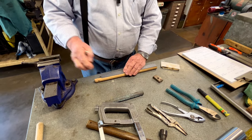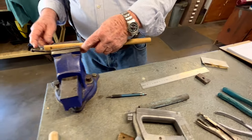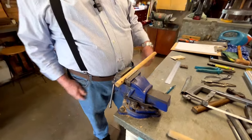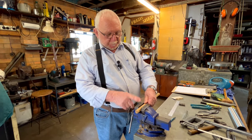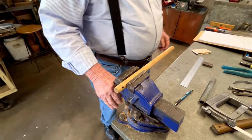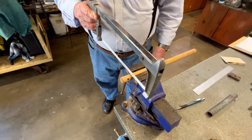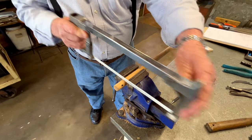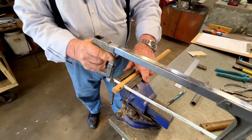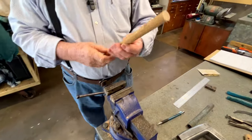I'm going to show you a few little tricks to make it easier. For example, when you're cutting a bit of this stuff to length, not many people can saw through a piece and end up with it straight. But if you've got a little vice, just put it in with the cut level with the end of the vice and use the vice as a cutting gauge. Your hacksaw does a nice smooth job - you just sit the blade up against the jaws of the vice and it acts as a guide. It's square.